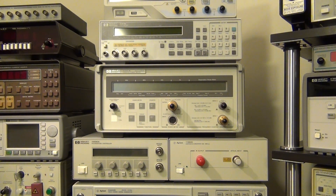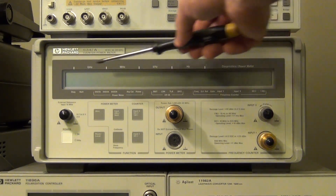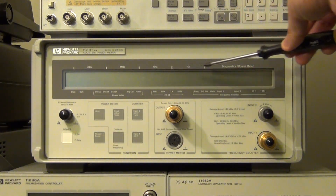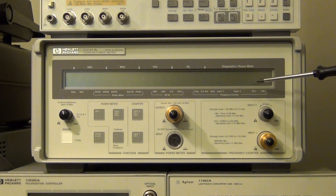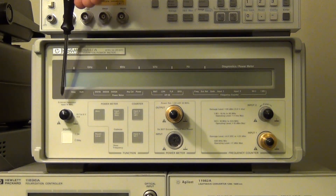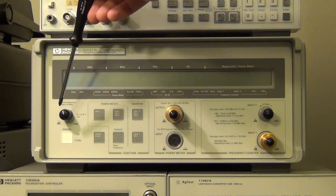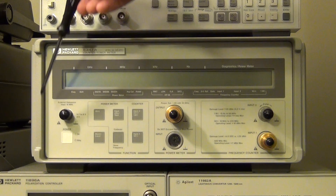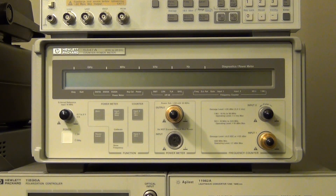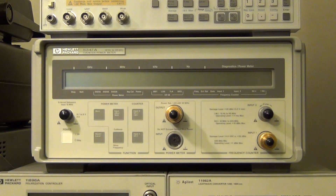Let's take a look at one of these units — the working one in my lab. In the front of the unit, you have a big LCD screen that can show alphanumeric values. It's divided into GHz, MHz, KHz, and so on. There's a bunch of indicators that can be lit up directly on the LCD telling you which input is selected. On the very left side, we have an external 10 MHz input reference. This is very useful because you're able to override the internal OCXO with an external calibrated 10 MHz reference, maybe like a rubidium standard or something very accurate. The frequency counter will then measure every frequency with respect to this 10 MHz reference.